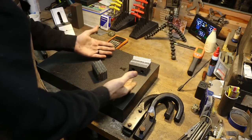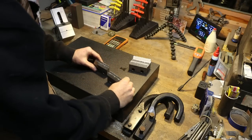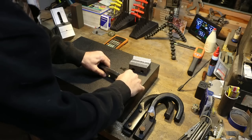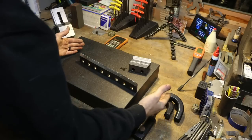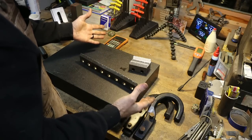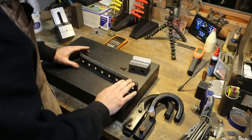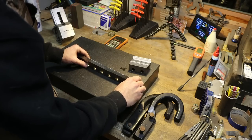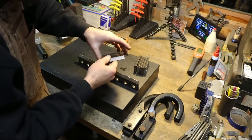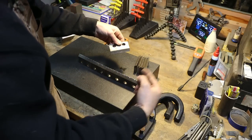So when I say chipper blades, I don't mean wood chipper, obviously. This is from a scientific instrument, actually, made to chip up biomass, hay, straw, same thing, basically, wood chips, oats, anything soft-wise that you need broke up into a specific mesh size or particle size, right? These four blades here are fixed. They're all identical in their height, and they are non-adjustable. These six go on a rotating drum that is adjustable, so you can change the distance in between these two blades, affecting your end particle size.